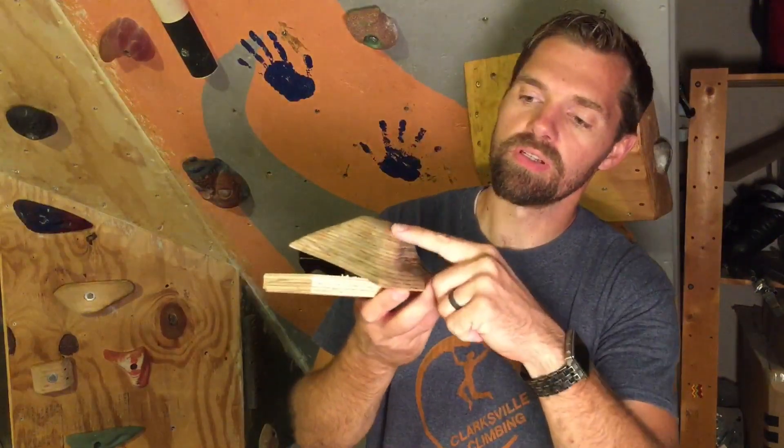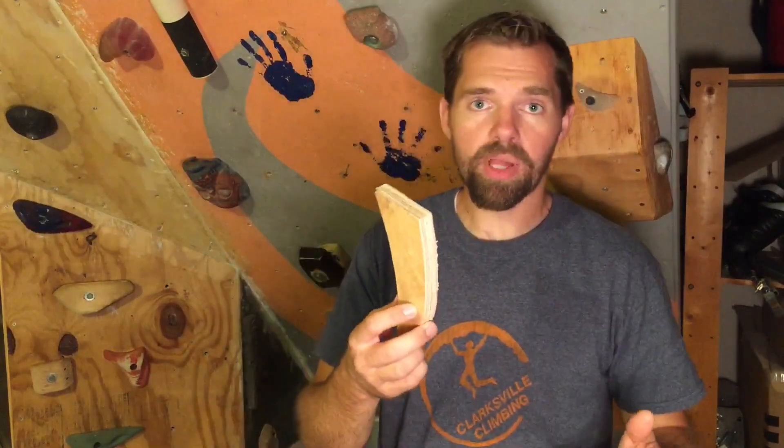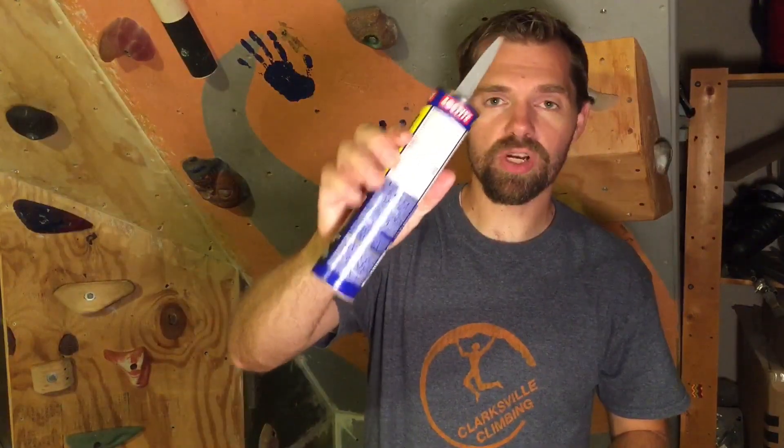The type of plywood you're going to use — this is made out of plywood, and that's how we get these different grains going on here. It just looks beautiful. You can use scrap plywood, and that's how this is going to become free. Make sure that you get good quality plywood, because if you don't, the possibility of it delaminating — where these different layers start to pull apart — is higher. You don't want that, and that's also why we go with the polyurethane construction adhesive.